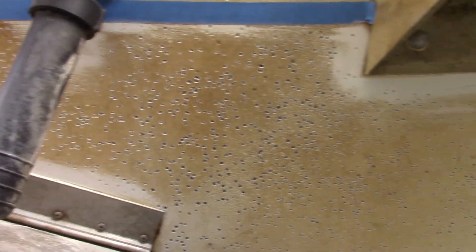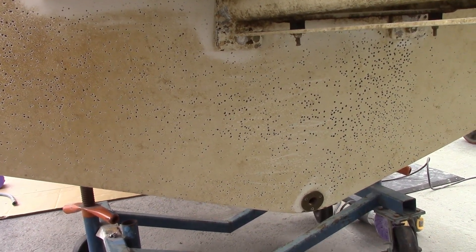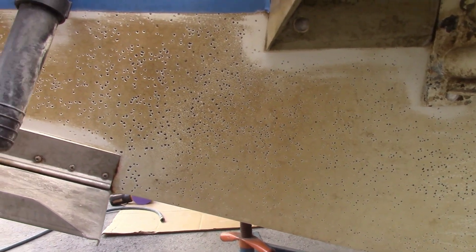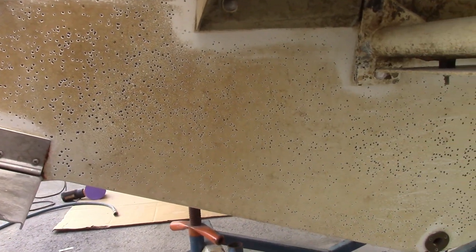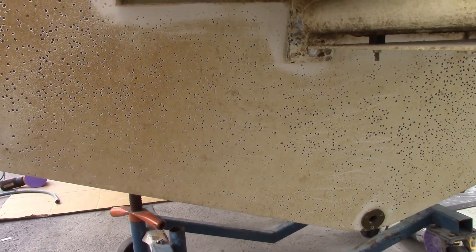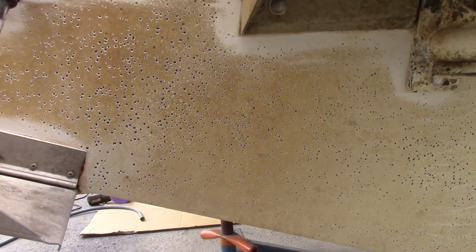So that's a good thing but we still have to deal with all these blisters. I've never had a boat that's never been bottom painted where the owner just left the boat in the water for so long. So now we're going to sand the bottom and go back to more pressure washing, because that'll make the gel coat layer a little thinner and should be easier to blast through them.